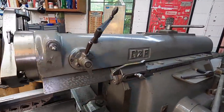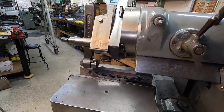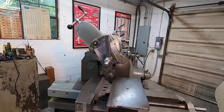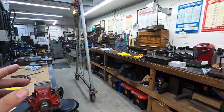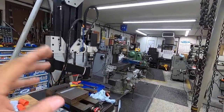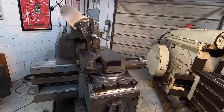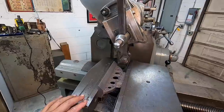You see how slick that works, cutting an angle on that? Setting this shaper up, I got this done a lot faster than if I was to go over to that K&T and try to rig it up in V-blocks, hold-down clamps, and things like that to cut it. I'm not saying that's a bad way to do it — I'm just showing you a really good example, like I always do, of why this machine holds its weight around the shop. We're doing things like this that are normally a little bit more tricky to do in a milling machine because of the setups involved.